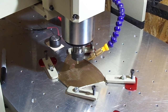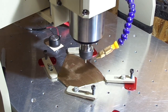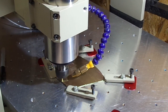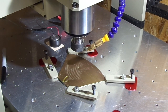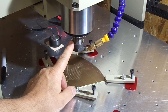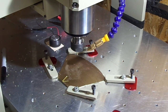Okay, here goes nothing — let's run this. I stopped it; it seems like it's a little aggressive, so let's start over. I dropped the feed rate from 35 inches a minute to 25 inches a minute, took the RPM from 12,000 to 15,000, and dropped the depth of cut from 20 thousandths to 15 thousandths. Let's see if that's any better.